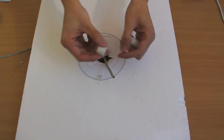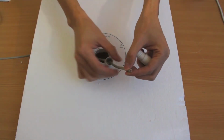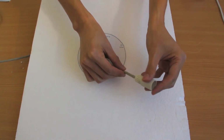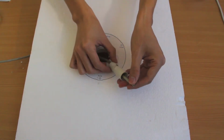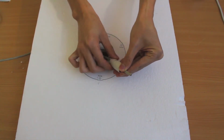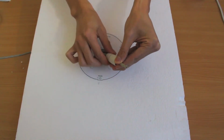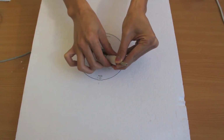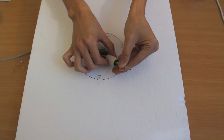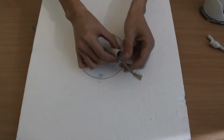Next, run the RJ45 cable through the fitting cap and the waterproof mechanism, and rotate the cap to fasten. Take note here, a RJ45 cable without plug is required for this step. After running through, then we will put a plug to this RJ45 cable.